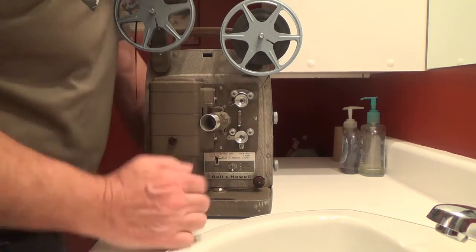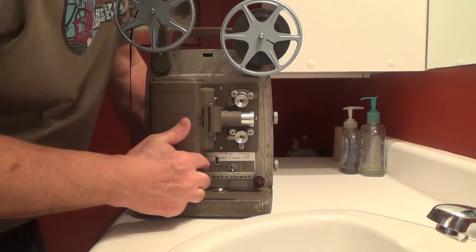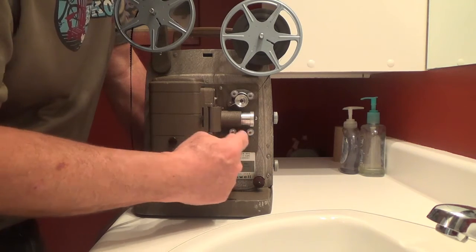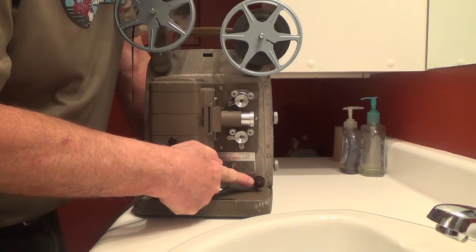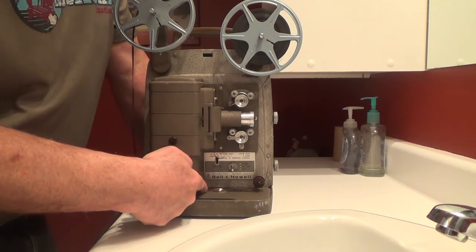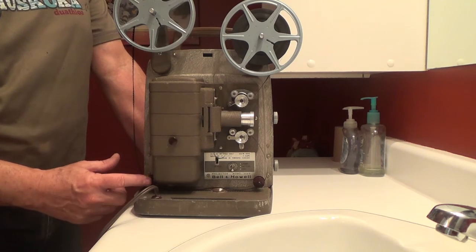Past the lens by just opening this little trap door, it goes down here. There's another loop here, and then the film is threaded through this pulley system again. Down below there's another little pulley — it's not mechanical, this is static — and the film goes along the bottom underneath the lamp housing through another pulley down here.